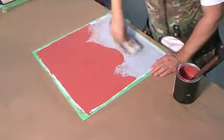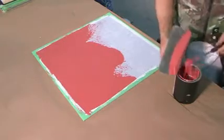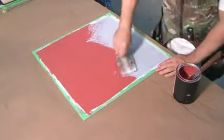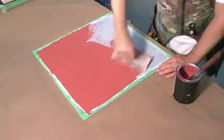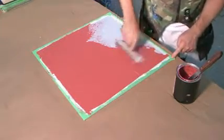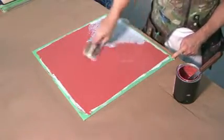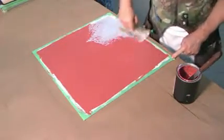Start by priming the area with VersaLime Quartz Primer. This will give the Marmorino a strong bond. When the primer has fully dried, coat the whole surface with a layer of Marmorino, letting the marble in the product guide the thickness of the application. This first coat will be visible after the final coat has been applied. You may wish to try unique undercoating movements to find the most appealing look for you.